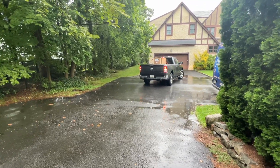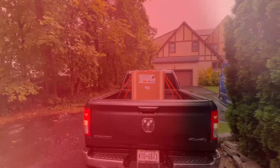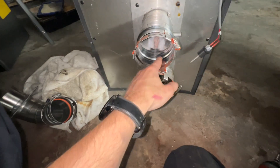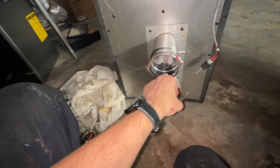Peter just got here, so we can get that boiler down there and in position. Alpine 210. We ran into a bit of an issue — this new unit is a wall-mounted unit, which had this box on it and this venting assembly. So we had to transfer the old venting assembly and get it all cleaned up. I have to get a gasket for this. I'm debating trying to take this one out intact or just seeing if I have the Alpine gasket in the van. We have to make sure that this stays in place when we slide the exhaust on — it's a real pain to do. We're probably going to have to glue it in like the existing one.